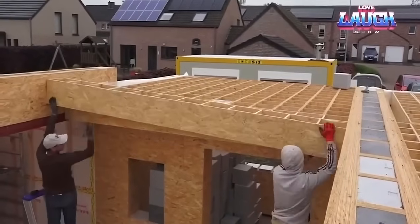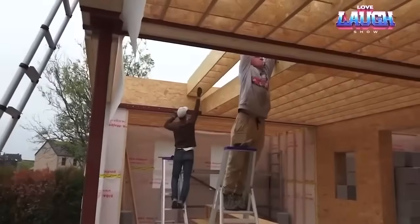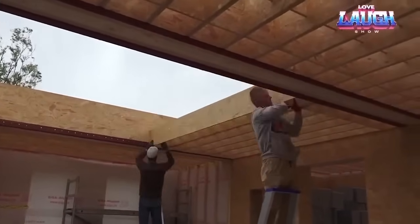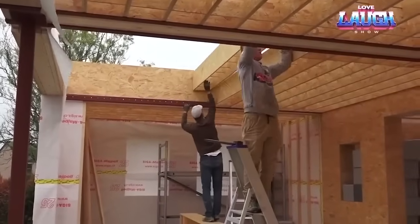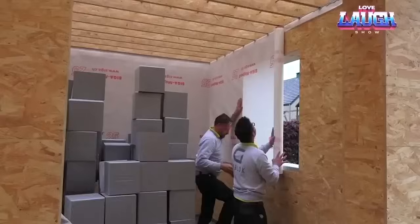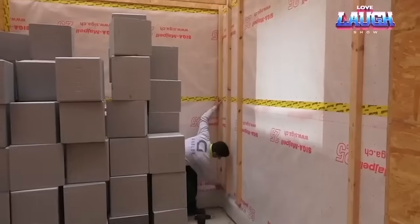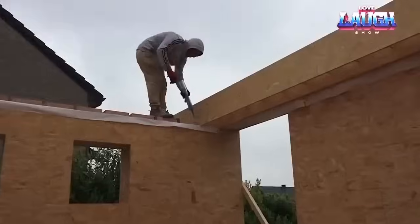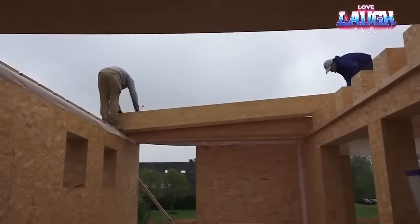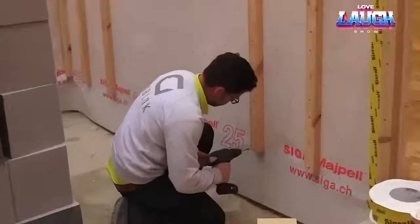The finished walls have good insulation characteristics and fully comply with the requirements of the International Directive on Energy Efficiency of Buildings. Construction with Gablock blocks is not only faster, but also easier. The weight of the smallest element is 16 pounds. That is many times less than the weight of a concrete block of the same size. The manufacturer also took care of technical channels for a simpler and faster installation of plumbing and the electrical system. Perhaps the only disadvantage of the material is the necessary drawing up of a very clear construction plan. The size of each wall is taken into account in order to pick up the exact number of the necessary blocks.